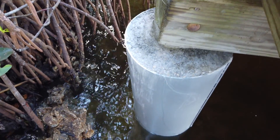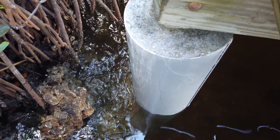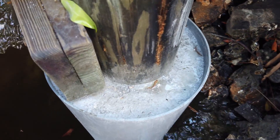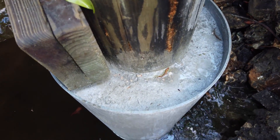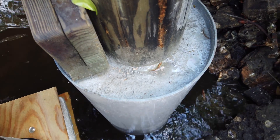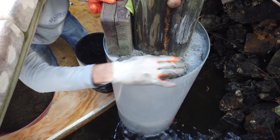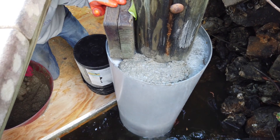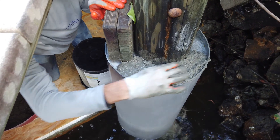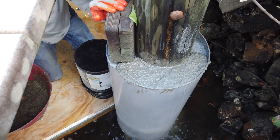This is an example of one that's already all the way topped off to the top. Next will be the coning process, and here's one of the last ones that hasn't been topped off yet. They poured the concrete yesterday and these are most of the way full — they pumped it in from the concrete truck. Now just adding the very top little section to top it off, which is going to allow them to cone it after this.